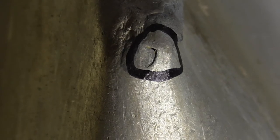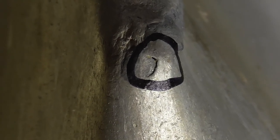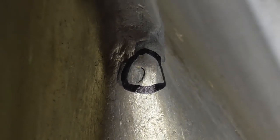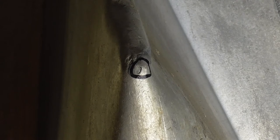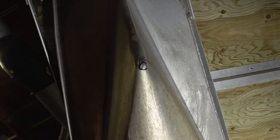So what I'm going to do now is hit it with a torch, just make it hot till steam comes out, because you don't want to blow a big hole in it. Then we're going to go ahead and clean this baby up with a stainless wire wheel that I got in my truck, and then we'll get to welding this thing. And I'm going to build it up a little bit because that's clearly right on the front of the tube, which means they're probably beaching it a lot right there, and that's probably why it got the hole. So kudos on this guy for not putting JB Weld or silicone on it and making me double the price,